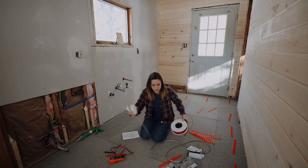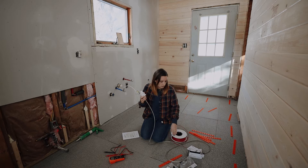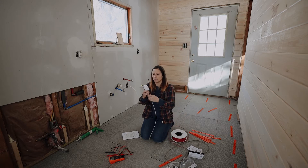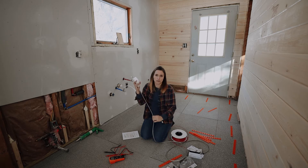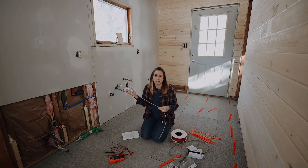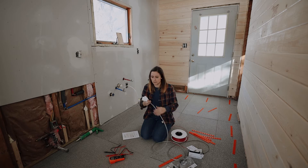The other thing that comes in the kit is a device called a loudmouth screamer. It's a device you hook into the cold lead of the system. So while you're running your cable in your floor, if you disconnect the cable, step on it, or accidentally cut it, this device will actually go off, letting you know there's been a disruption in the system. The last thing you want is to pour the mortar and then be stuck with a damaged cable.